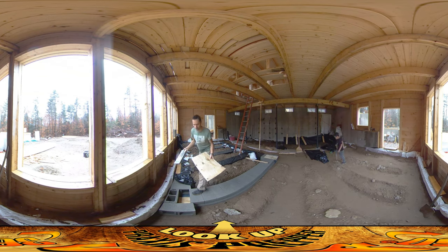On top of this, because there's going to be six inches of concrete over in the corner, I'm going to make a little wooden assembly — kind of like a box — that's going to sit on top of this. The concrete will get poured up to the sides of that, and once it cures, we'll disassemble the box. I'm going to make it so it can be easily disassembled — take out the pieces — and that'll leave a nice little hole for the register to engage right on top of the concrete over there.